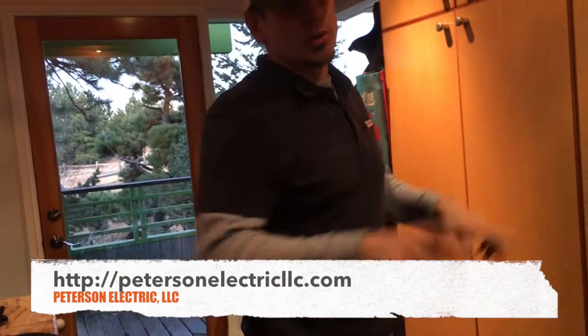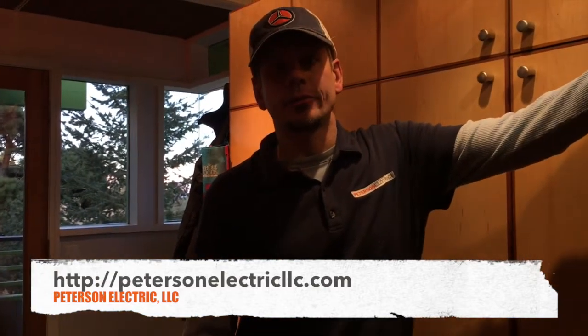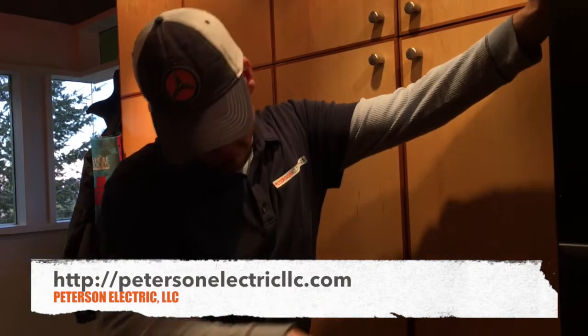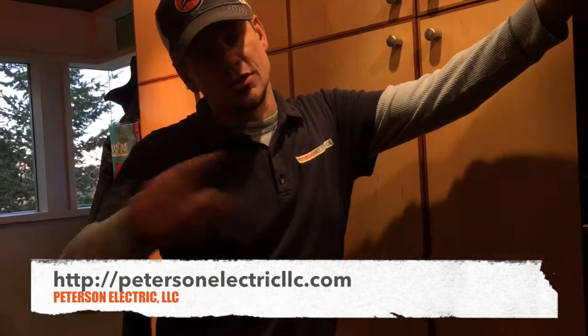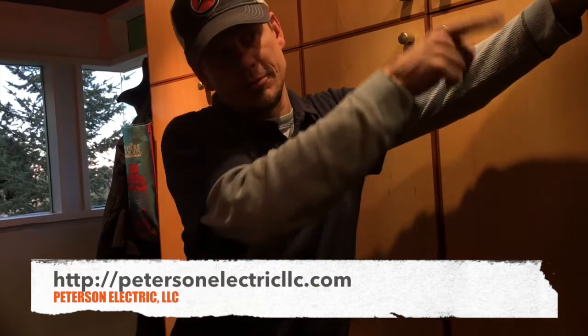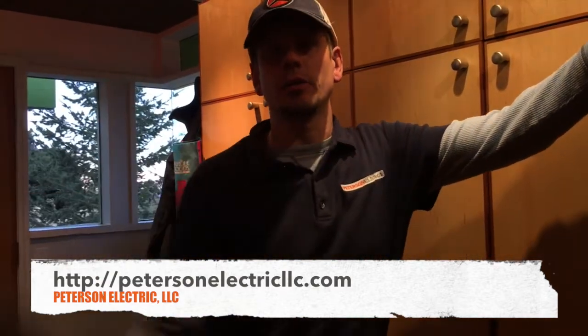So if we were going to run two at once, you know, that's close to 24 amps. We'd have had to run a 10 gauge wire at 30 amps and daisy chain it either through the cabinets or down below and hit two spots. And we just flexed down below, put enough straps, got that up through the eave, and it was only about 10 foot till I hit the panel on the inside.